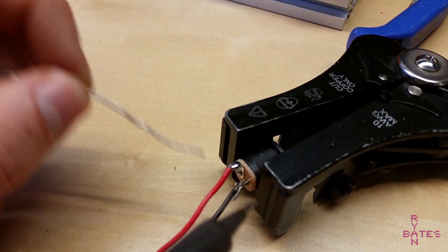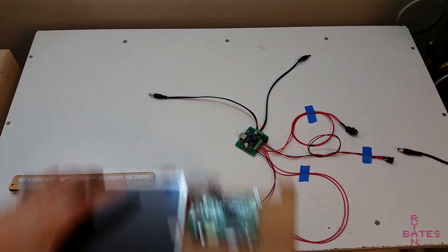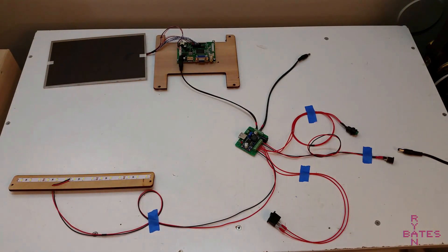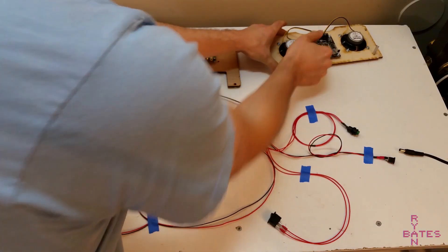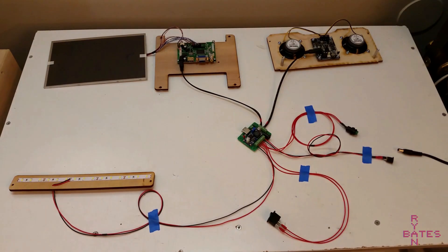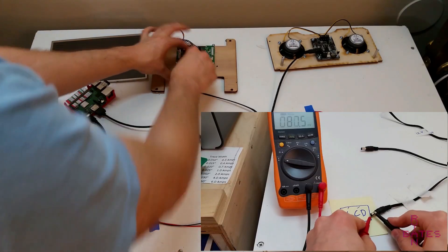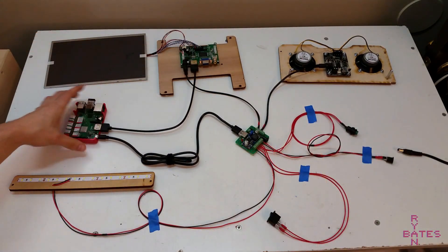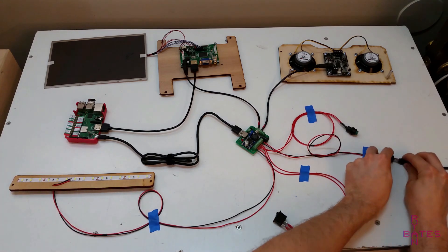One still has to cut and strip wires to the appropriate length and solder or crimp leads from each switch and power jack connection. But again, all these are labeled and hopefully self-explanatory. Here's an overview of how I build my arcades — connections are much simpler compared to wiring without the power block. The amplifier and LCD used in my kits have a DC jack for input power. It's important to wire with the correct polarity when using DC pigtail cables. I highly recommend using a multimeter to verify which wire is the center pin, which should follow the center positive standard. There is more than one way to connect the Raspberry Pi — USB connection, screw terminal, or jumper wires — all available on this PCB.